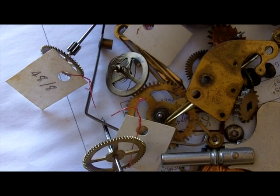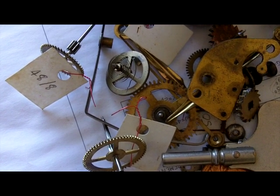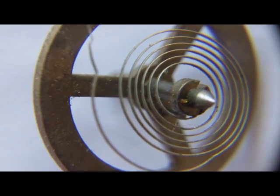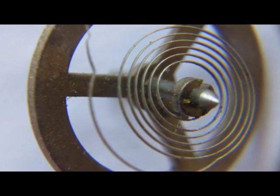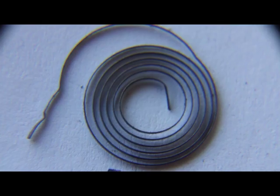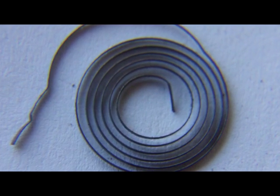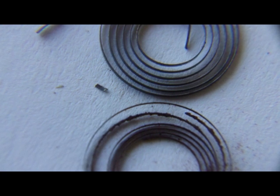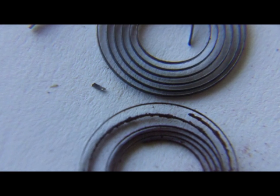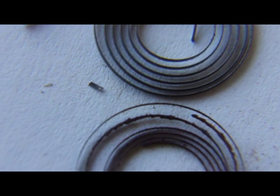It was time to raid my clock components, and fortunately I had a balance wheel with a spring still on it that I hadn't thrown out. Although this was a heavier gauge spring than the original, I decided to give it a go and fit it to the original collet. Here you can see the new spring and a comparison with the old spring. The old spring had 13 turns to it, so the new spring is substantially stiffer and less resilient than the original one.